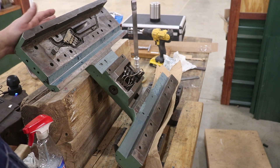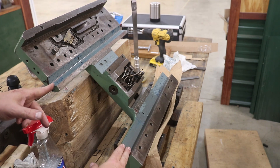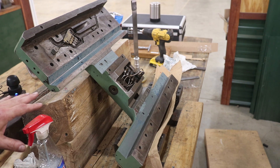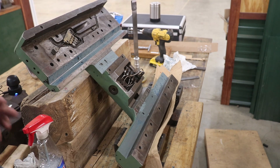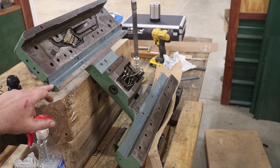This is what the bottom is looking like right now. We're primarily focusing on this front way — that's the one doing the alignment. The back one is just sitting flat on the surface, so there's not a whole lot of alignment happening there. We've started bluing up the ways and looking at the contact. We're about two thousandths out of alignment right now. While we don't have a whole lot of contact, it's encouraging that we have contact all the way through and it should clean up pretty good. On the flat side we're getting more contact up there than over here, so we're trying to bring that side down a little bit.